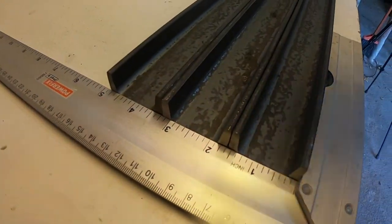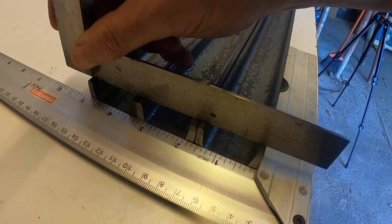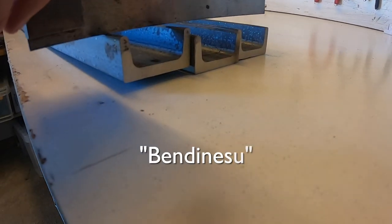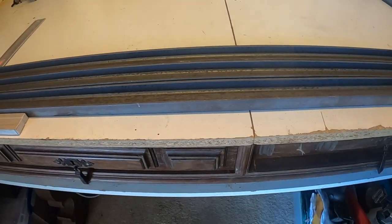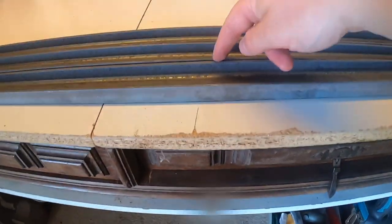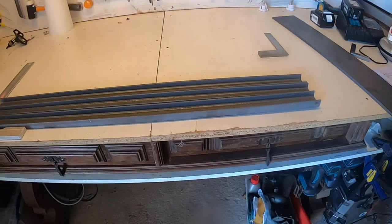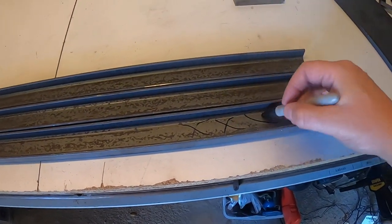I hope this comes out on the camera. This is why I need to check everything — these ends here are level, they're all good, but the table is not level. There's a pretty big discrepancy in the bendiness of that one, which means this one here is bent. You can see it starting to bend around here; that shadow there is decreasing. So this section here is not good. You're going to have to mark it with a triple X.